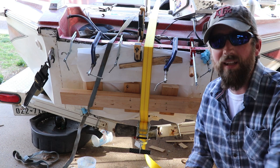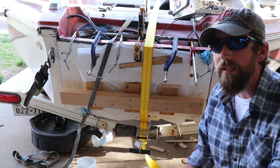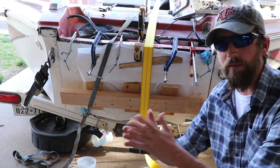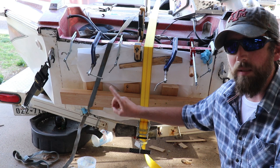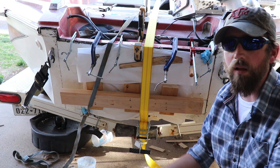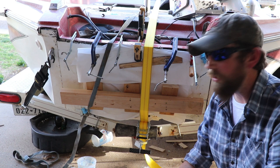It's not overly pretty at the moment, but we think we got it all put together. We are not professionals, so this is not a professional job, but it's something you can do in your garage in your spare time. For the brace, we just put two-by-fours with cross braces to span the whole length of the transom. We used parchment paper — or plastic — between your clamps, your board, and the epoxy, because everything will stick to the back and you don't want that. That's the end of part four. Next time we'll bevel the edges, make sure everything's smooth, put some more fiberglass strips in, and then after that is the gel coating. God bless, have a great safe afternoon, and we'll catch you on the next video.